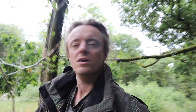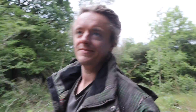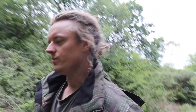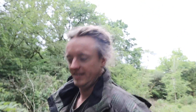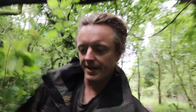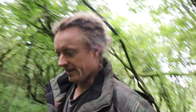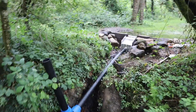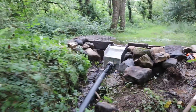I'd like to address something a lot of people will ask: why not just run more water through the turbine? That's also an option — I might drill out some of the smaller nozzles if I need more power. But at the moment I'm just trying to tune the system and get it working really well. The best way to do that is by getting the water we're currently using to retain the most amount of energy. Once I have it to that point, if I want more power I can drill out a nozzle.